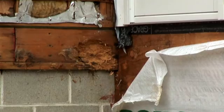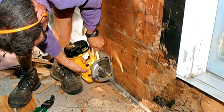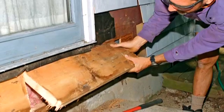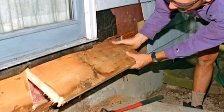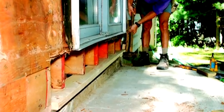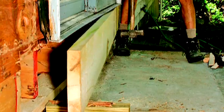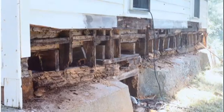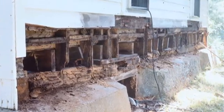The most important thing to do is to identify the source of the moisture infiltration and correct it. Repairing rotted or damaged house framing is beyond the scope of what we can explain in this DVD. However, when building a new deck, we often get the opportunity to peek under the hood of our house. Most of the time, we can spend a little time to repair the damage and then move on. If you do find significant damage, then you may have to address that before continuing to build your deck.